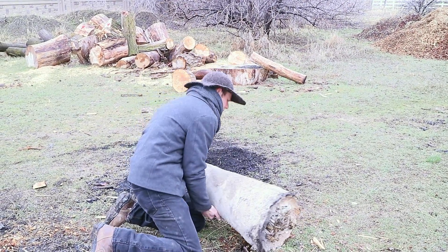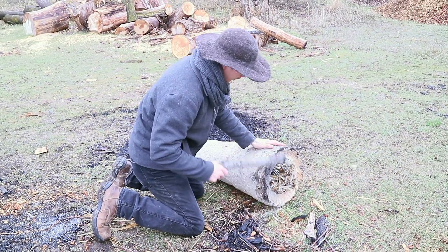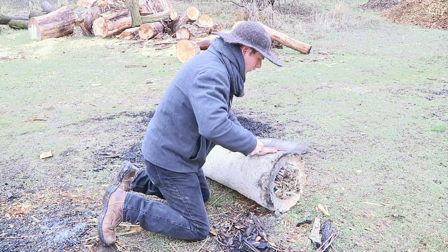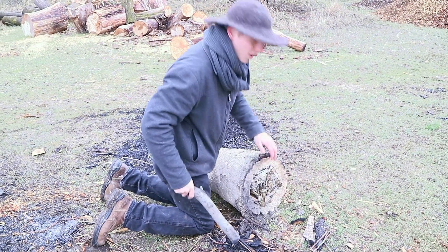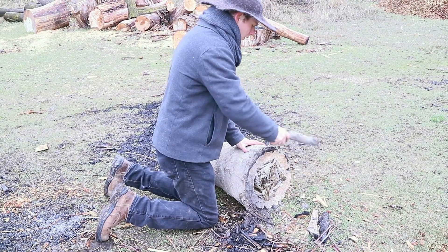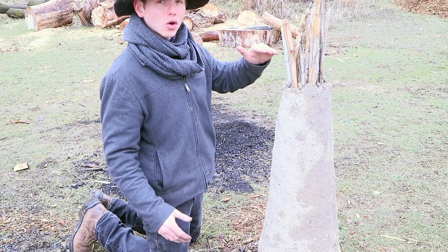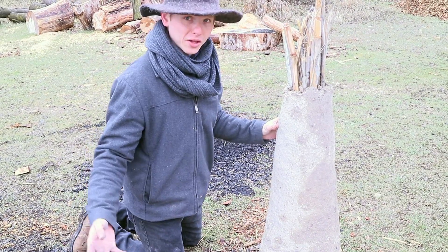We're going to set this down and then clean this up. The reason it's concave like this is because this is actually the leftovers of a previous furnace that we made and then added onto. This furnace is called a bloomery stack furnace, and the way it works is it's basically a chimney that you fill with charcoal and ore, and you let it burn its way down to the bottom. Somewhere in here we need to carve an air vent for the air to come in.